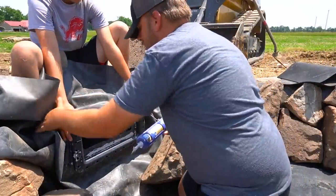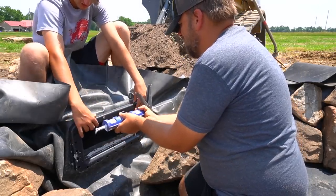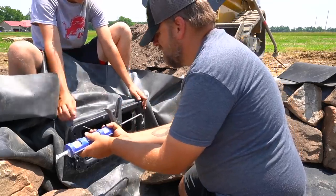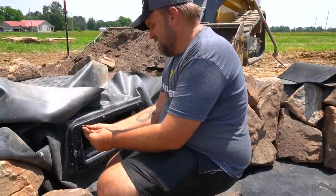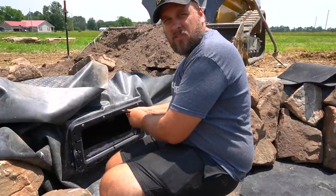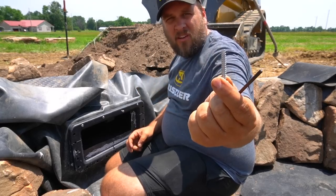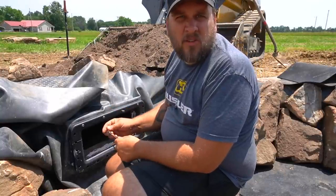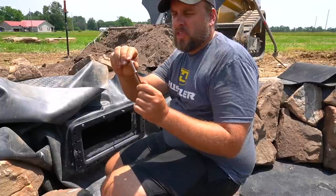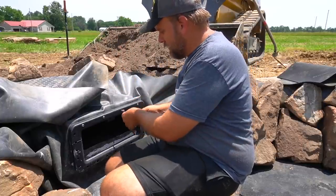Just kind of keep the same amount of spacing on the edges and all the holes should hit. One second. Check that. Okay. Now 21 screws. Now these are long-winded screws. And I was thinking, with a screw that long, why not run them in with a screwdriver bit? But actually it makes perfect sense to use this hand tool, because you're only screwing in about 3/4 of an inch of threads, and it's such a coarse thread, it only takes a couple turns to be tight.